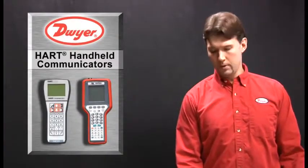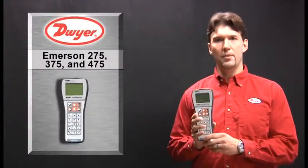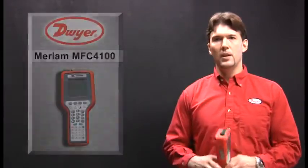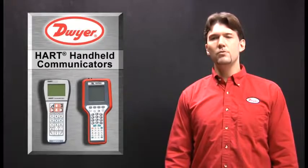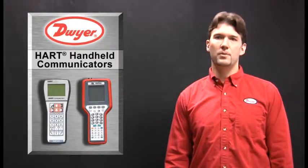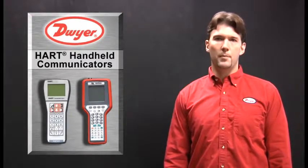The most popular HART handheld communicators are the Emerson 275, 375, and 475, and the Meriam MFC 4100. Now take note, to access all of the transmitter's parameters with an Emerson 275, 375, or 475, the HART handheld communicator must have our device description files, or DDs, which is only available through Emerson.